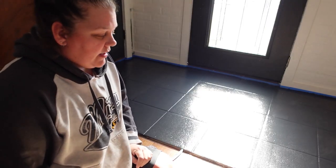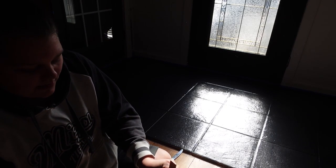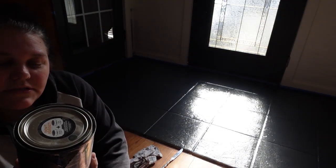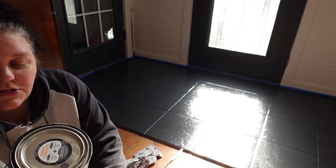It is definitely not one-coat coverage. I'm going to have to come in with at least a second coat of this color, maybe a third. The instructions say base coat dry time is six hours, full system — allow 24 hours for light foot traffic and 72 hours before replacing furniture. Avoid dragging.